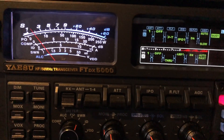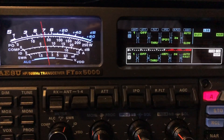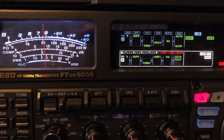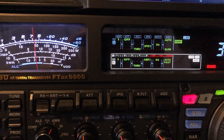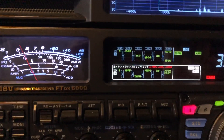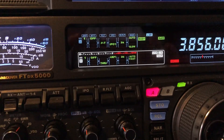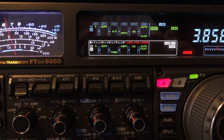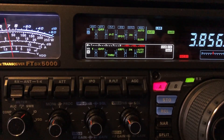Let's see what it would sound like without all that. Turned off the pre-selector, disabled shift, disabled DSP, turned off narrow, and turned off digital noise reduction. There we go. Tremendous what you can do with the DSP features in combination with the Microtune pre-selector and also engaging IPO. You really don't need an RF amplifier in the front end on the 75 meter or 40 meter band.